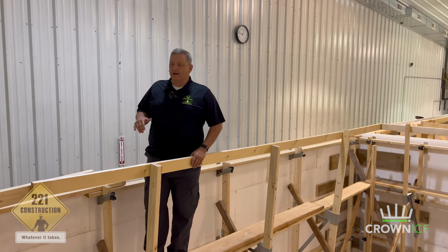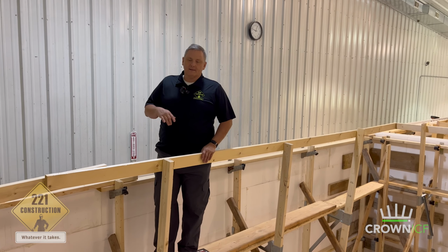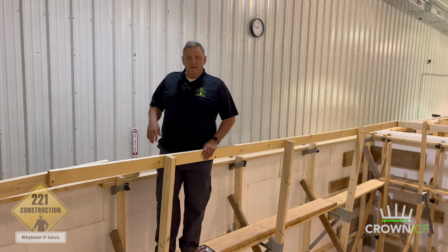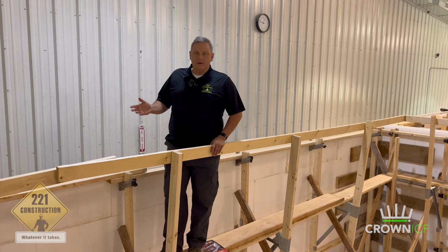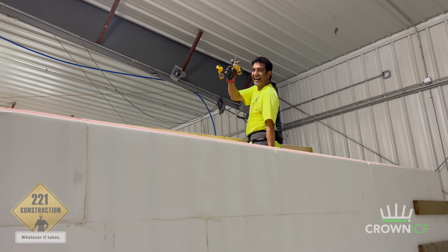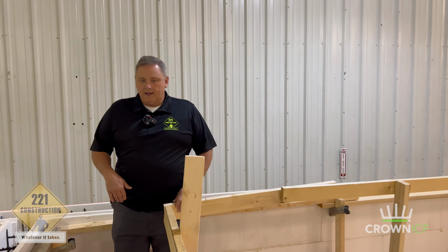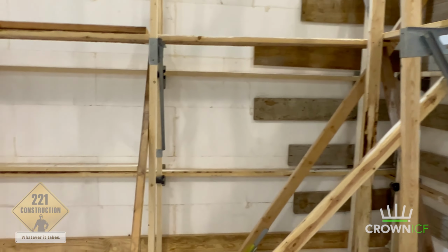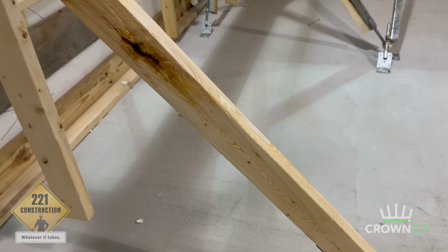Okay, we're up on top of the scaffold here so that I can show you just basically a view of what it's like to be up on this system that we use called the Zonts, Zats, and Zuckles. Kind of a funny set of terminology, but this bracing style allows us to go vertical through the block laying and the pours so that we can quickly assemble and disassemble, and we can reuse the bracing in order to go to the next level. You can put walk planks in on these lower pieces so that you can also have a place to walk when the concrete goes into the block cavity. They've got something stable for themselves to walk on, which also produces a handrail on the back side because of the angle of the bracing itself.